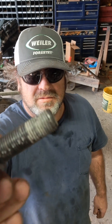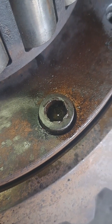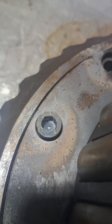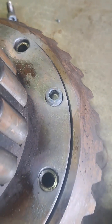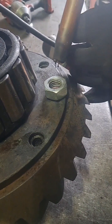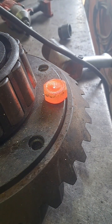It really gets tricky when they've got loctite on them. That one was already spun by the previous person — I hadn't even tried it yet because it's already stripped. I either stripped two of them if I didn't wait long enough, or they were already partially stripped. So I'm going to have to weld nuts on top of those — fill the socket head in first with weld, let that heat start working down toward the loctite, then put the nut on it, let it rip again, and let it cool until the red glow goes.